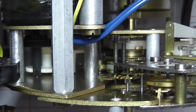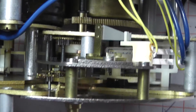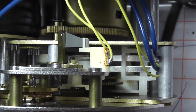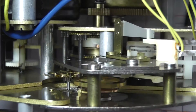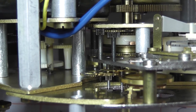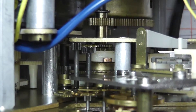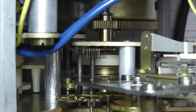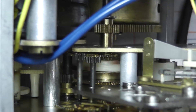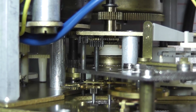This Venner clock is very well made, but there is a sign of the times — it has used some nylon components. The high-speed gear wheels are made from nylon or some type of plastic, whereas in older-type clocks the high-speed gears were usually made from fiber. On the center arbor, this is a type of clutch which allows you to advance the dial to the correct time position.